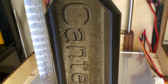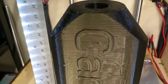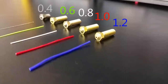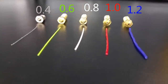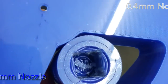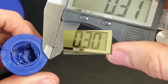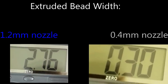It does several things quite well actually. It prints very big, it prints fast, and it prints incredibly strong. This hot end is for people who want to make prints that are as strong as possible. Things like mounts, brackets, and cases are ideal for this type of hot end. It's not really for people who want intricate little figurines with tiny critical little details. The bigger diameter nozzles that come with the Volcano — 1.2, 1.0, 0.8, and 0.6 millimeter — produce much bigger beads. Typical nozzles are only around 0.4 millimeters in diameter. A bigger bead means more volume per layer comes out, so prints are built much faster — I'm talking two to four times faster. Wider beads also mean much more surface area contact from layer to layer, which drastically improves layer bonding adhesion. Most prints fail because of layer adhesion, not because of the mechanical properties of the plastic.